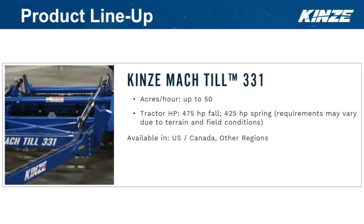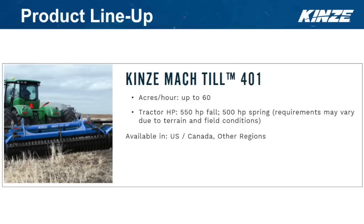And I always say, as I've been talking to customers, if you're on the edge of what your tractor can do, I would say step down to a smaller size and make it up in speed to get your acres per hour, because you really want some power on standby, because being able to go in that 7.5, 8 mile an hour range is what the machine is really designed for. So don't try stretching your tractor too far, because you will not like the results.